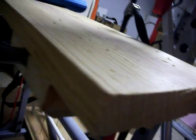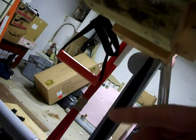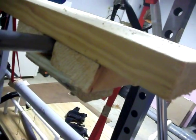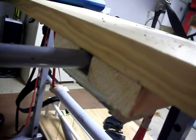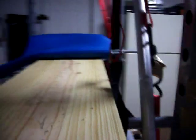I literally used 2x4s along with a 2x10 to create a box for the safety pin for the power rack. Underneath, you can see there are two other pieces of 2x4 to create a solid bottom to this box so that the pin loads in through the hole and there's nowhere this can go — you can move about a quarter of an inch and that's it. So it's secure. I've got six 2.5-inch screws on each of these blocks holding them in, as well as these horizontal ones, so they are very, very secure.